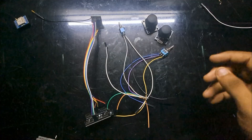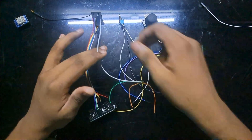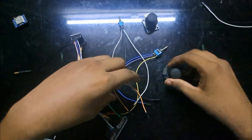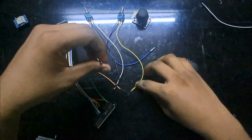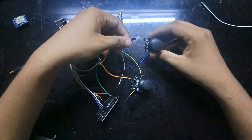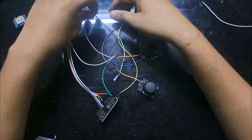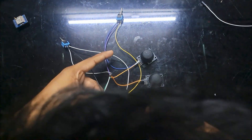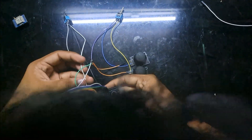Now take the VCC wire — you get one connection for here, one for here, and two or three wires total. Connect the VCC to your LoRa module, then connect the VCC to your joysticks and the switches. For the switch wiring, the GPIO pins are 25 and 13. Take the first switch and connect it to pin 25.